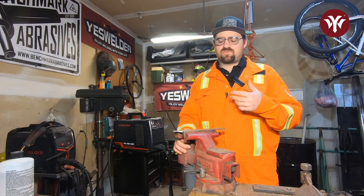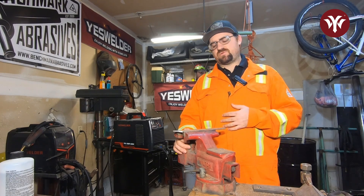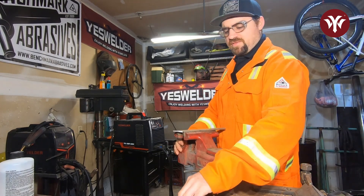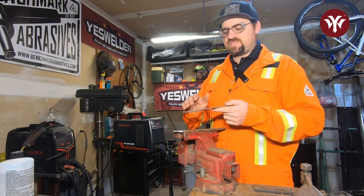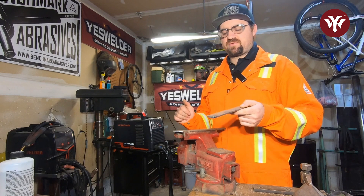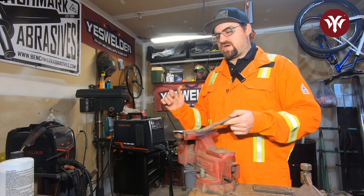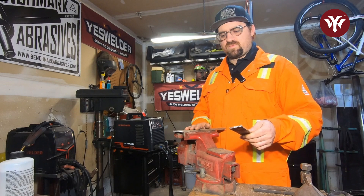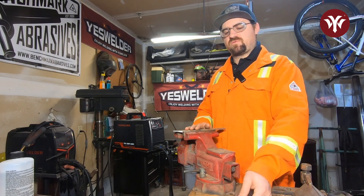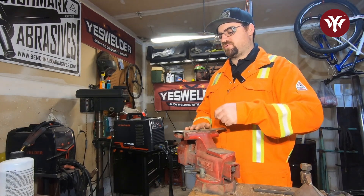In something like TIG welding, we're going to use both just to be safe. On metal like this, we're going to have to use some sort of abrasive method. You could sit here with sandpaper and sand this all day, but we've got the benefit of electricity and power tools. I've got a grinder with a flat wheel and we can grind it up and clean it up that way. And then we've also got some chemicals that I'll show you how to use.